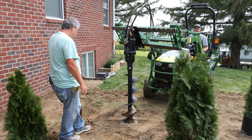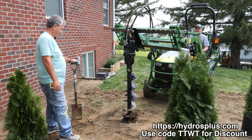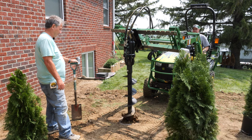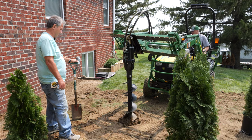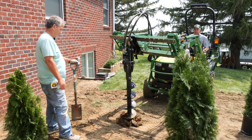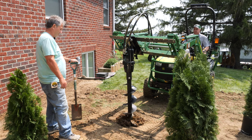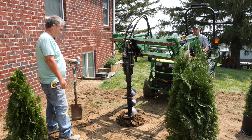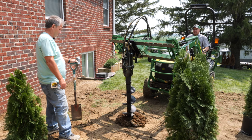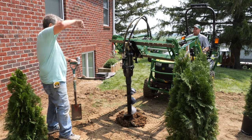In addition to having the post hole auger — the Auger Plus from HydrosPlus.com — I've got Kevin's fancy little switch which will make the third function run continuously. This fits the standard John Deere third function handle as a direct replacement. So it adds, in addition to the up and down switch, a continuous flow. I'm running at idle — it's supposed to require six gallons a minute. Do you want deeper or just waller? Waller.